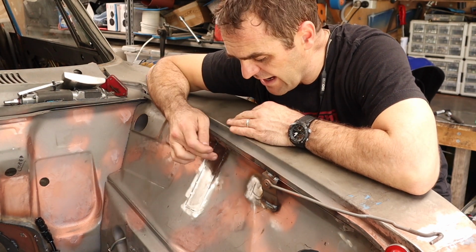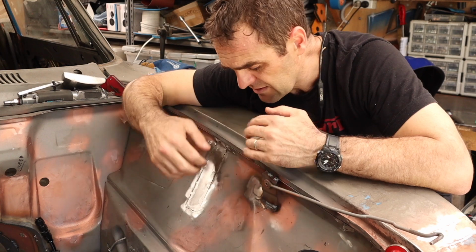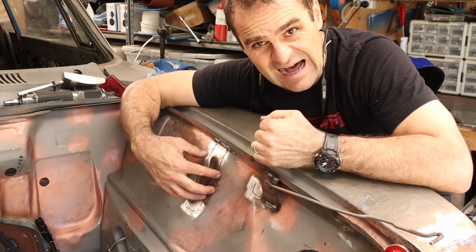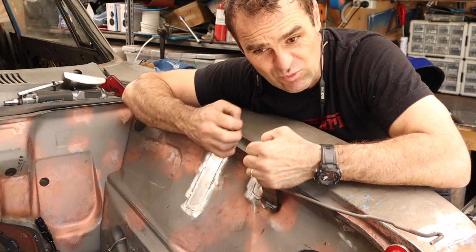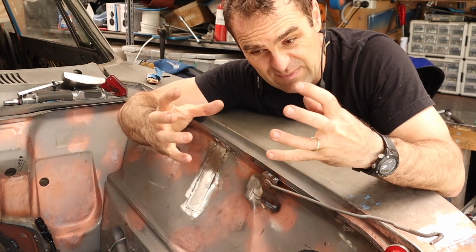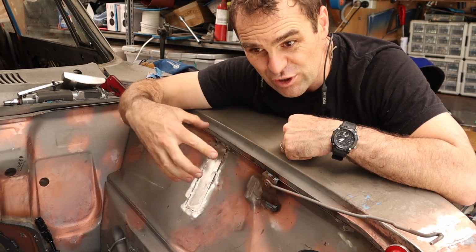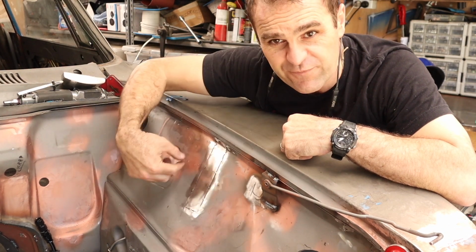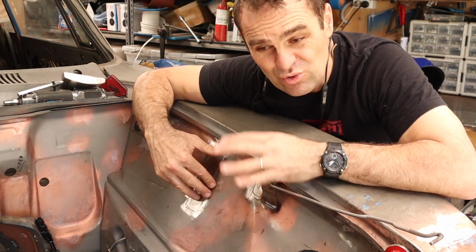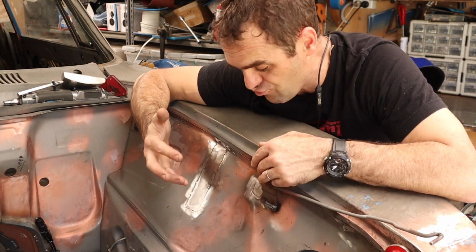The issue always is with welding, and you can do this with a MIG, and you can spread out the welds, but no matter what you do, the metal is going to warp and pull. So basically what you're doing when you're welding is you are taking the base metal, which is already hard, solid, as shrunk as it's going to be, as it wants to be, and then you're adding liquid metal, which is as expanded as it's going to be, because obviously the hotter it gets, the more it expands. So this liquid metal is expanded, goes into the gap, and then as it cools, it contracts. And each weld will contract and basically pull all the metal in from around it. So there's no real way to avoid that. You can put gaps in it, you can spread it out. Whatever you do, it's going to be pulling that metal all the time. It's just physics. It's just the way that the metal reacts.